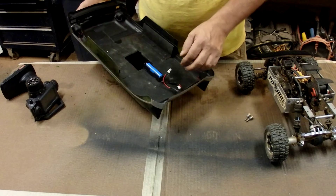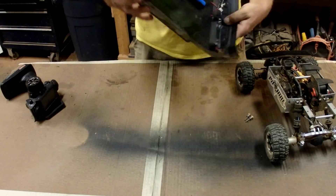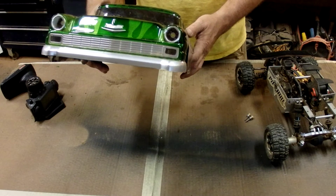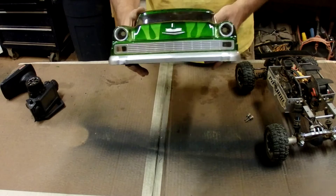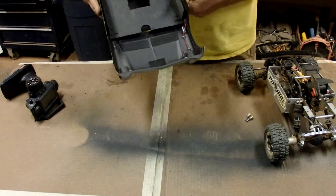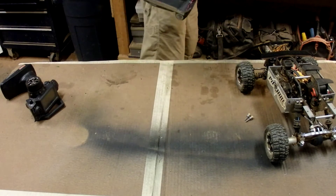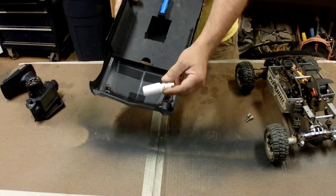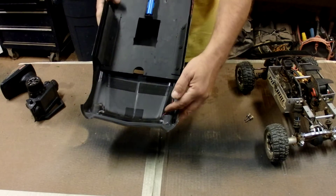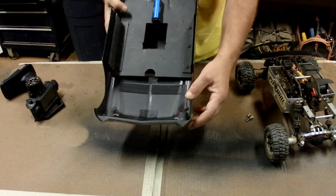This is an 18650 battery — I just put a 3-pin Molex on it. I've got lights in the front which I think are pretty cool. If you look at them, you'll see it's an LED on a little star heat sink. Those are 3-watt LEDs, 230 lumens each at 3.7 volts. And then I took some white plastic dropper bottles — cut those down, made buckets for them, threaded wire through them, filled them with epoxy, and dropped the modules in. It's completely waterproof and stabilized.